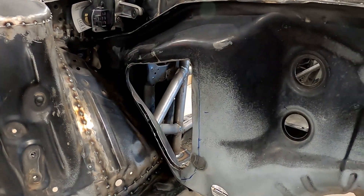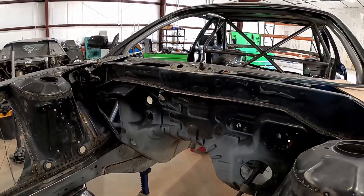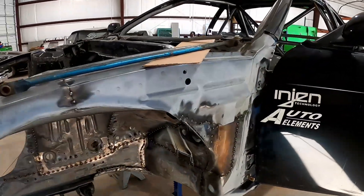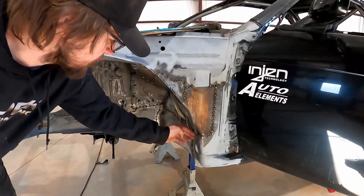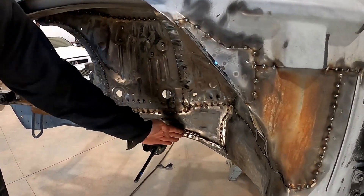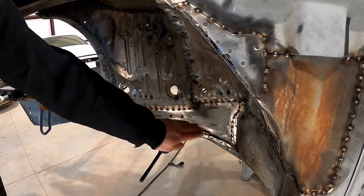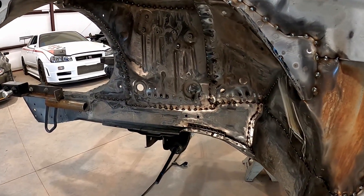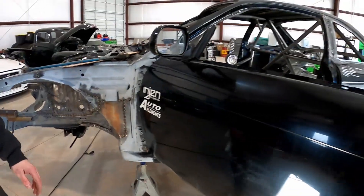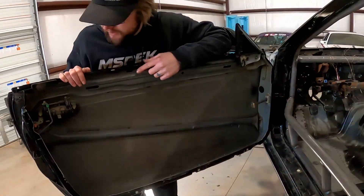We started cutting holes in the firewall - that's where my bulkheads are all going to go for coolant lines, wiring harness, all that good stuff. The stitch welding is done underneath all the way back. The wheel wells are all cleaned out and hammered - this is normally a lip that you can cut the tire on, so that's hammered. Same with this area out here - if you get excessive angle you'll catch it, so we go ahead and hammer it up, stitch it, try to make it integral while modifying it.